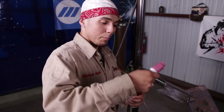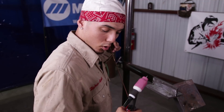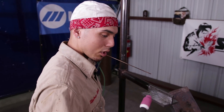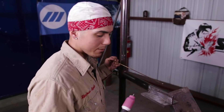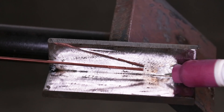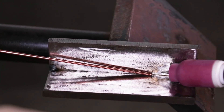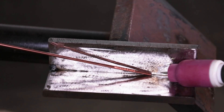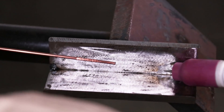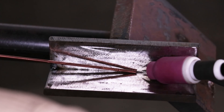On the basis of TIG welding at any technical high school or welding school, you're going to start off with T-joints. That's just the way it is. When you start off with T-joints, it's going to give you the basics of how to wiggle the cup in there on a flat surface when you have two metals combined. We're going to wiggle the cup — we're not walking the cup. Walking the cup and wiggling the cup are two different things. Wiggling the cup onto the walls, just like this, all the way through.